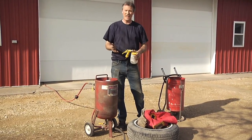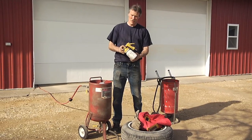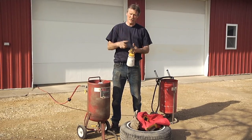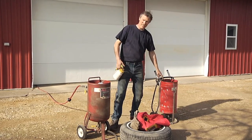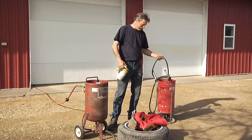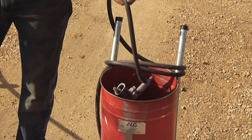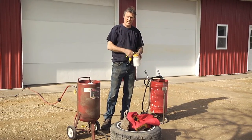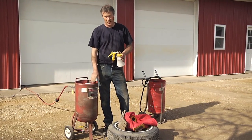There's several different kinds of sandblasters. There's little mini blasters if you just got a real small area. There's gravity feed sandblasters that have a hopper on top of the gun and as you pull the trigger it feeds sand in. A very common type you find at most parts stores is a siphon feed, where you hook the air up to the sandblasting gun and as the air pressure goes by it draws sand up.